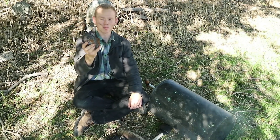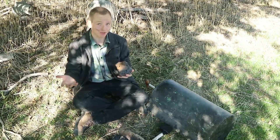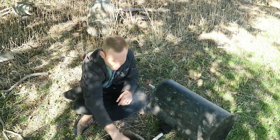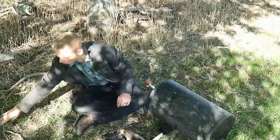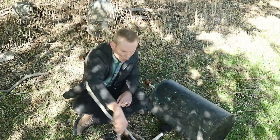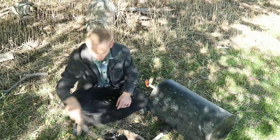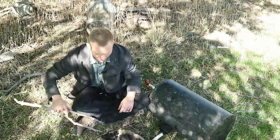This is the iron bloom. As you can see, it's been a couple of weeks because it's already started to rust. However, that is a really good sign because it means it's real iron. So I'm going to throw this down in the forge that we've got preheating, and then pack the charcoal all around it with these wooden tongs that we're going to use to pick up and manipulate the bloom. Then we're going to try roasting this thing up to temperature.